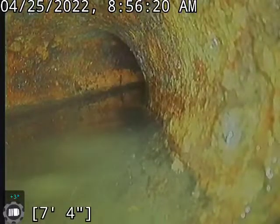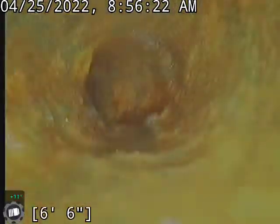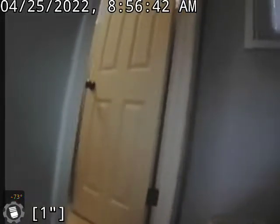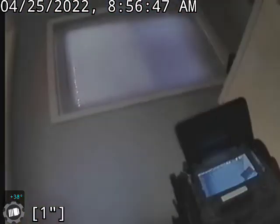On this line is where we had heavy scale buildup, and as we broke it down, this is coming back towards the floor drain that we did access it from. Did pretty good trying to push the scale out of there, but further down the line it was just pretty hard. We ran a lot of water — here's the access point. There's a bathroom right here and then laundry and dryer. Thank you for watching.